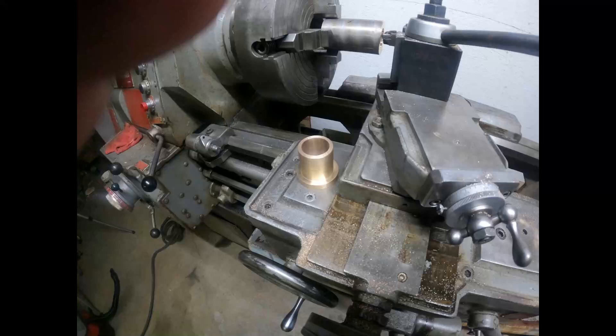Here's one completed bushing — I parted it off and trued it up a little bit off camera. That bottom surface, that step there, is going to be the thrust washer kind of surface where the rod runs against this bushing, because this is actually going to be inserted from the inside of the piston. That will be just a surface there for locating it in the piston. I'll do another one off camera and then we'll be over on the mill.